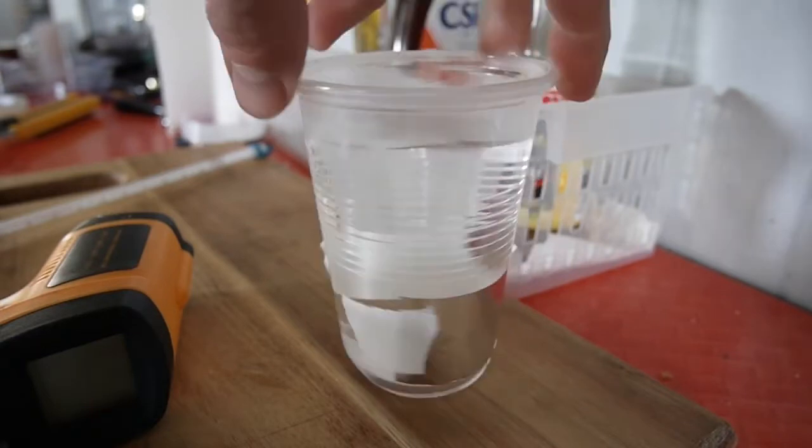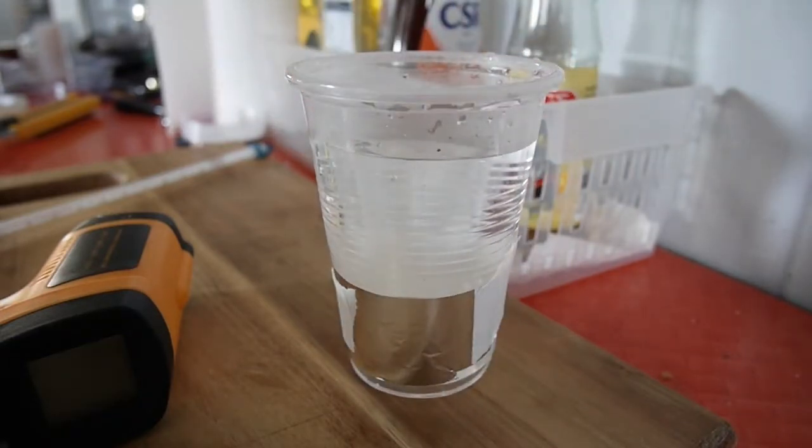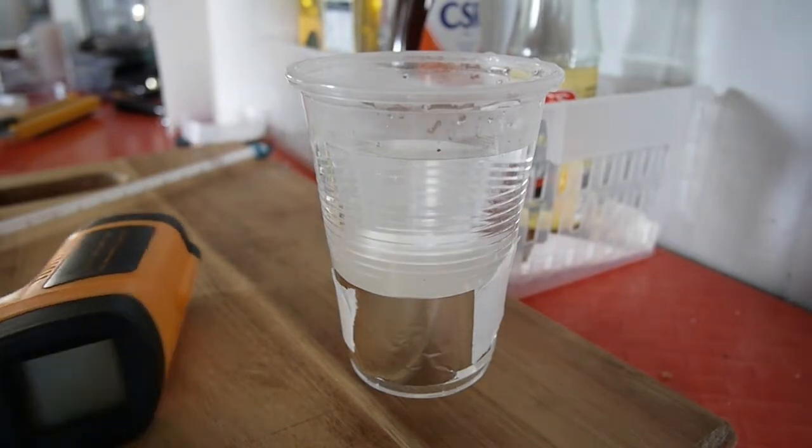So the difference between the two readings can be understood based on the concept of emissivity, and that silver things such as heat shields in cars around the exhaust system are silver because they don't actually emit radiation. They're very good at reflecting radiation, but they don't emit radiation.